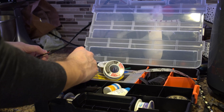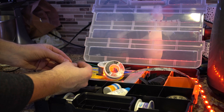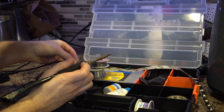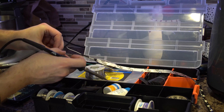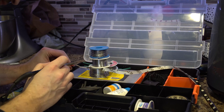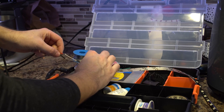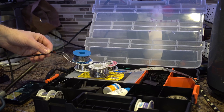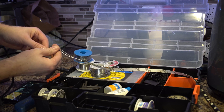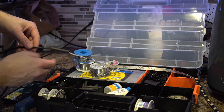I'll do one more quick test just to make sure we've got the right sides — I believe white was the power. Yep, so we're good. Now just to protect that connection, we'll run the heat shrink over top of it. We're done with our solders, give it a couple seconds to cool, then slide our heat shrink back on top and seal these up. We'll just use a lighter, go over it a few times, and that heat is going to shrink that tubing on top of it, which seals everything nice and tight. Then we'll slide the larger heat shrink back over the whole thing to seal this whole connection.